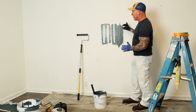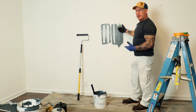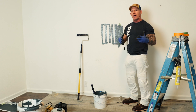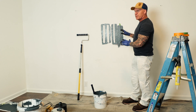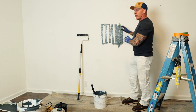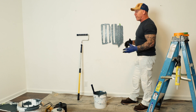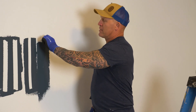There's also a method of painting the same color that's underneath the tape over the top of the tape. If I've painted white and I want white, paint white over the tape, let the white dry, and then paint my dark color over the top. That white bleeds underneath and it's the color I want it to be, so it pre-seals the tape. The downfall to that method is you can't paint right away — you have to wait for the white paint to dry. With the caulking method, I can caulk it and paint right away. That's how I used to paint before I discovered this caulking method.